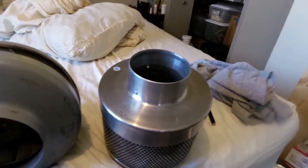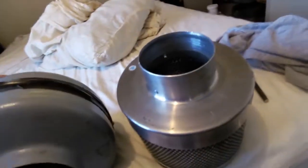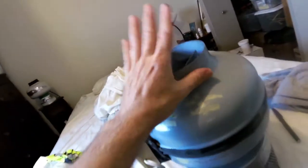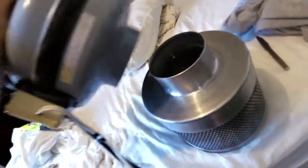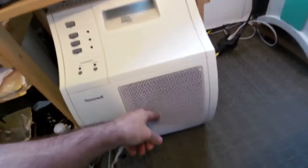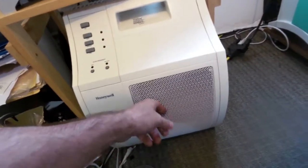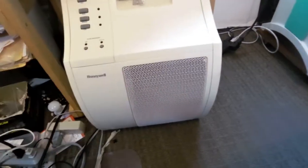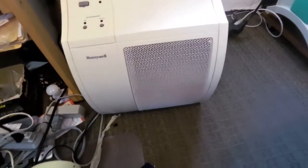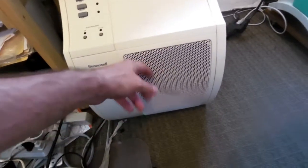One way around the carbon dust is to put your fan on, then attach some ducting — or just do it direct — and put that air to the input of another air cleaner, like a HEPA air cleaner, and let that suck the air in. The carbon cartridge will get rid of the odors, and the HEPA will get rid of any residual carbon dust.